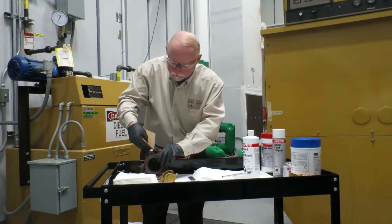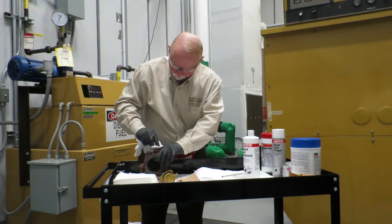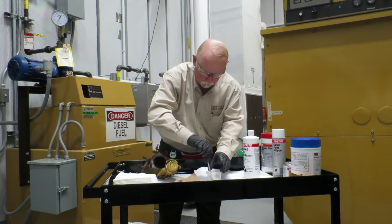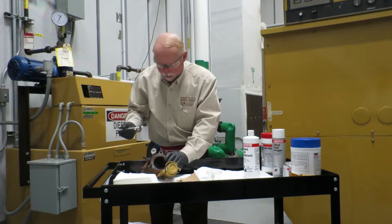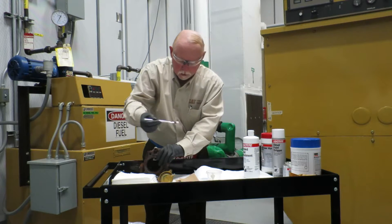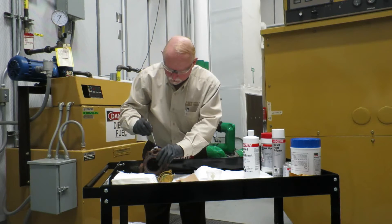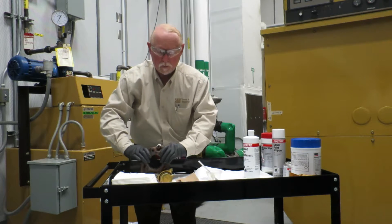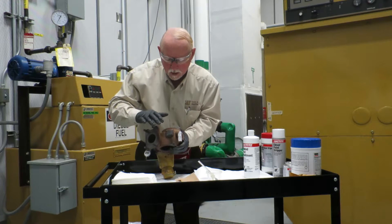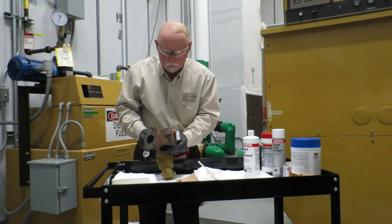For those of you that say you hate having to get all the rust off — you don't have to. Just get it cleaned up, wipe it down. We've got a little bowl here and I'm going to brush it on with a brush. When this goes on, it's kind of a light grayish-white color. Just dab this on — I always wear gloves, and use your safety glasses too. So we'll just wipe that on there like that. See right there? See how white it is? After 15 minutes, it sets up, dries, and it's almost like a primer.